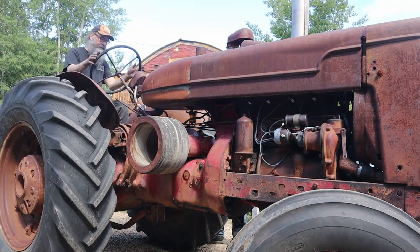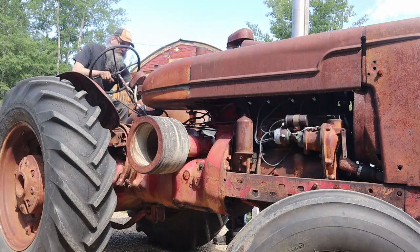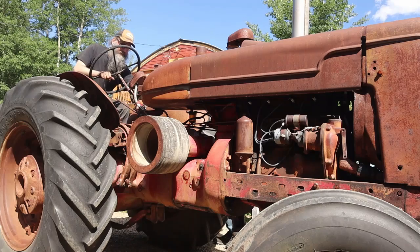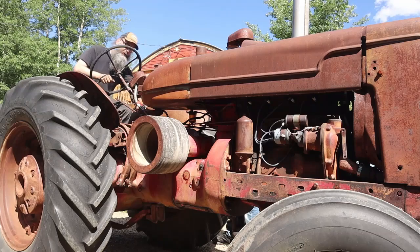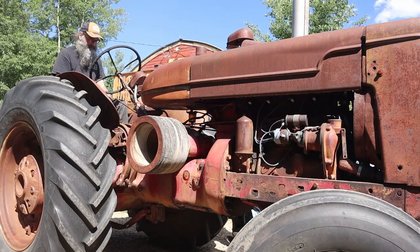And Matt said he's got headlights for me, so we might get a 6-volt battery because it's supposed to be 6-volt, and then we'll see if we can get the charging and everything working, because right now it's showing that it's not charging. Well, my neighbor has problems with this too. He put three sets of points in there. They got to be clean. He got new stuff and it still doesn't work good.